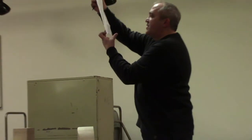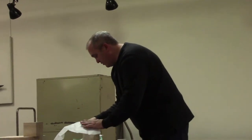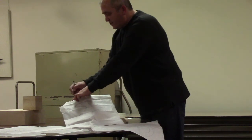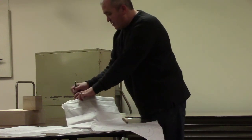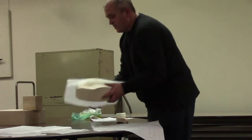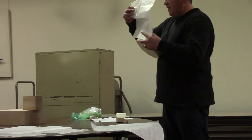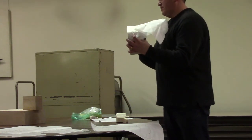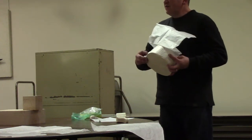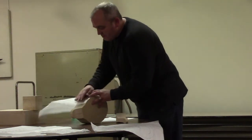That side pocket is from the front of the shoulder, starting at the front, working its way through the back. So I'm going to lay the front of the decoy pattern onto the decoy body cutout and trace that on the top of the side pocket. I'm going to stop about halfway back, because this is a round surface and this pattern is flat. If you lay that on there, you're going to end up about an inch short. So what you've got to do is slide this pattern back so the back of your side pocket pattern matches up with that line. Then you end up fudging something in here a little bit.